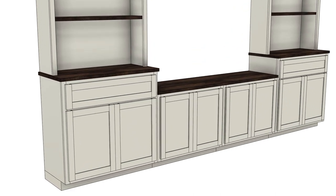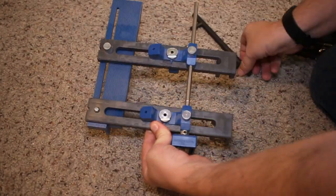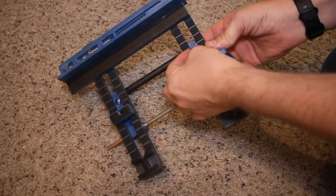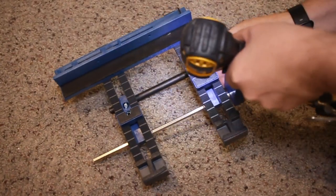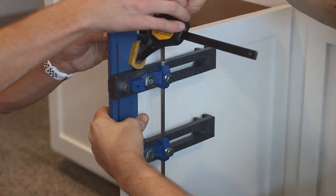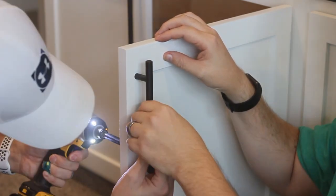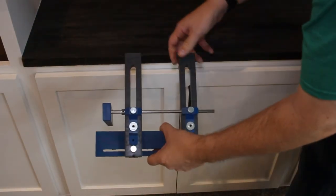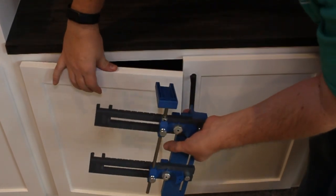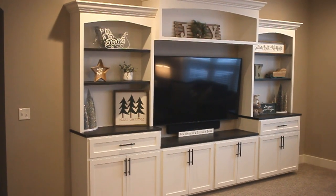The very last step was to put on all the cabinet door and drawer pulls. This can be a pretty frustrating task, especially if you accidentally make one crooked or mount them slightly uneven. But to eliminate that risk, I'm using the Rockler jig for mounting this kind of hardware. You can actually mount the hardware onto the jig itself and lock in the spacing so that it's perfect — it takes all the guesswork and measuring out of it. Next I set the offset bar so that the handle gets mounted at an ideal height, lock in the stop collar, drill out a couple holes, push the screws through, and mount on the handle. And that's it — it couldn't get any easier. Once you're done with all the right side doors, you can do the left side by removing the extendable stop and sliding it back in from the other side. Adding the cabinet hardware really did put the finishing touch onto this whole thing.